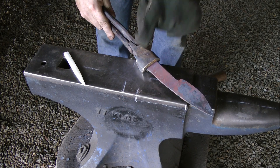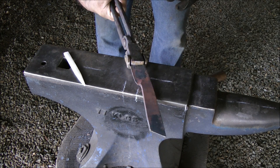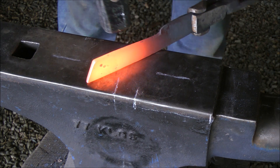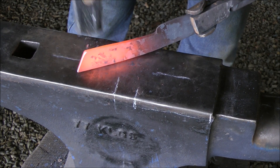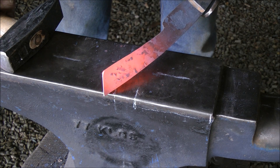I can't hold it there and forge it there, so my blade will be flipped around — I'll be holding it like this and then hammering my tang. My tang is all heated up. All I want to do now is just bend my metal ever so slightly, hammering the middle — same technique as used on the edge. And I've got that sexy little curve going there.